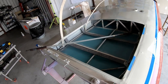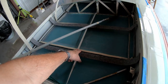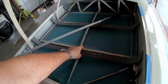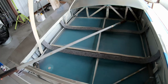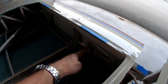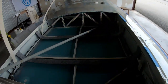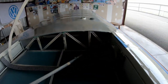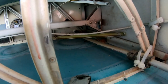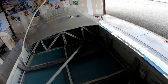I prepared the tank bay for the tank to go back in. Put all new felt here, and on the bottom strap there's also a Univair part number for felt that goes on the rib here. I don't know why, because I wouldn't think it would touch, but since there was a part number I did glue that in. And then also on this part here, where the tank straps go onto, you put the felt on. After the tank is in, this tube goes all the way across and through the wing as it attaches. I tried earlier and I probably have enough room to actually, while the tank is in, get in with my hands through the rib, but we will see.